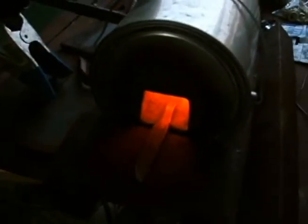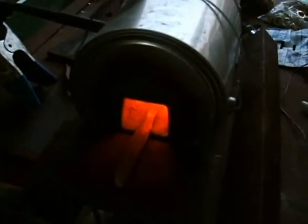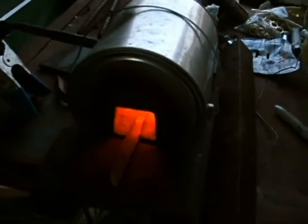You know how that is in there? A butter knife's just in there to gauge critical temperature, so I know when to cool things off and get ready to harden my knife we have waiting here. Messy table, vise, quench tank, and this here is a straightening anvil that was made out of the other piece of this forklift tine.